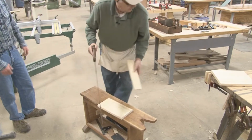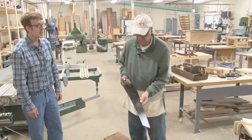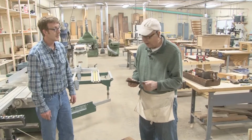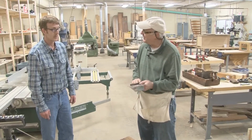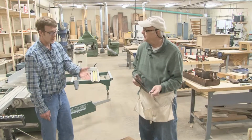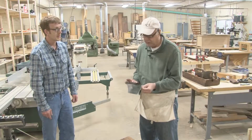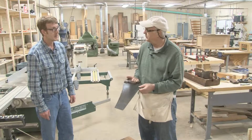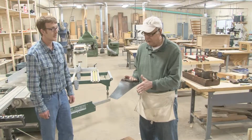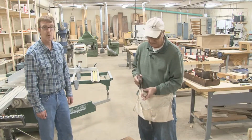Now, I know a lot of folks probably have their father's or their grandfather's old saw in their basement or in their attic someplace. You're going to be offering a saw tune-up class in the summertime, is that correct? Yes, we're going to take Grandpa's old saw and tune her up so she cuts just like that. So how well the saw is set up is going to determine how good a cut you're going to get. Yeah, if you are a good sawer and the saw's not properly tuned, it's really difficult to cut to a straight line. Okay, so that's an important part of this. Contrarily, if the saw's tuned up right, it's hard not to cut to the line because it tends to track a line. So be looking forward to that class. Yeah.